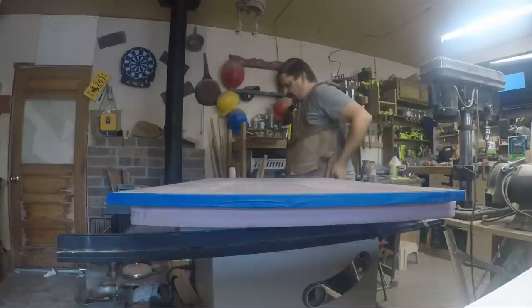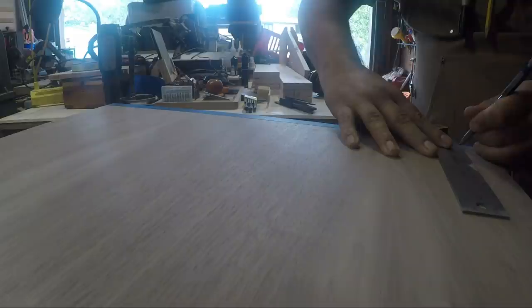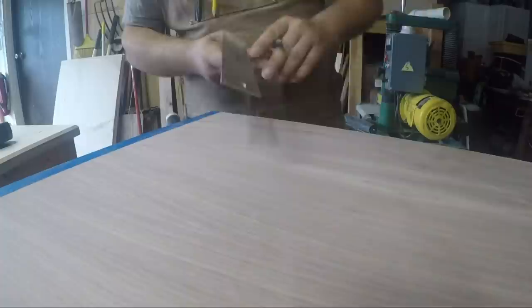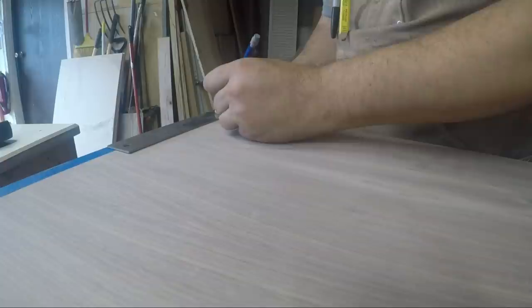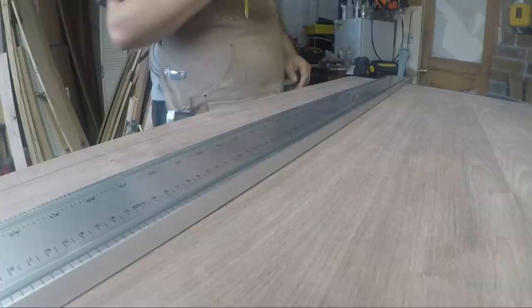After all those were cut down, I took my walnut laminated plywood — this stuff's expensive, but I wanted a walnut and maple set. I originally ripped it down from a full sheet to exactly four two-foot by four-foot sheets. I'm marking it here to 22 and a half by 46 and a half inches — that's an inch and a half off the total size — so when I add the three-quarters-of-an-inch border back in it will be exactly two foot by four foot. That's why the maple was exactly three-quarters of an inch thick.